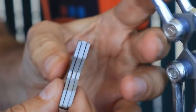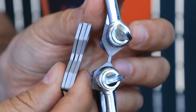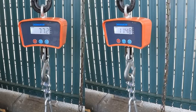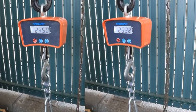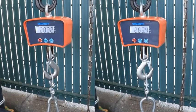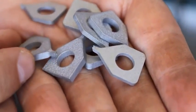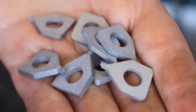Again I can see maybe three perimeters and the rest is 100% infill. Now the metallic test objects — don't forget the smallest cross-section area here is 2 by 2mm. Theoretically the middle specimens should test layer adhesion but as mentioned they are all printed in horizontal position. All broke properly at the smallest cross-section area. It was so hard to break that I didn't watch the scale, but you already saw the numbers a few seconds ago.